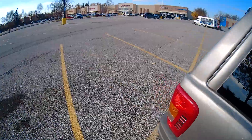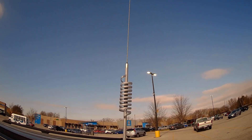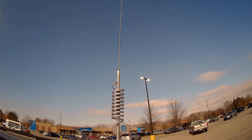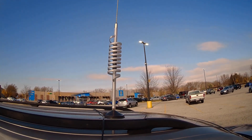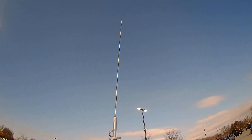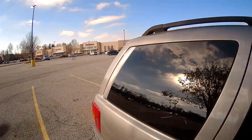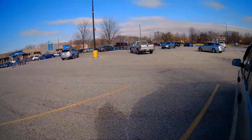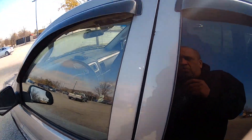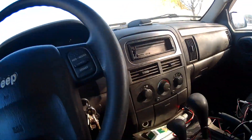You can see how the connectors are. I have a K40 quarter wave whip — that antenna can handle 20,000 watts, and it can actually handle more than that because quarter wave whips can hold a whole lot of juice. That's a quarter wave whip, the K40 antenna. They're very easy to set your SWR for any given frequency between 10 and 12 meters.